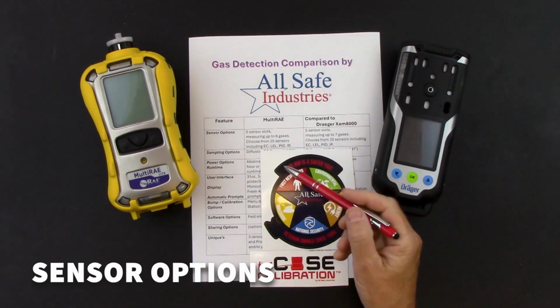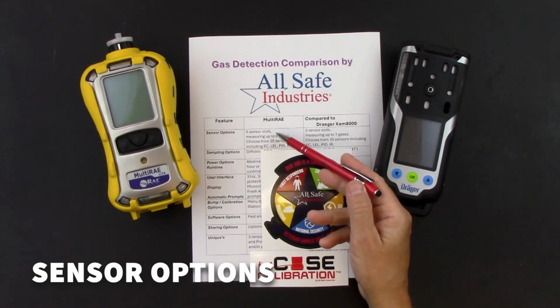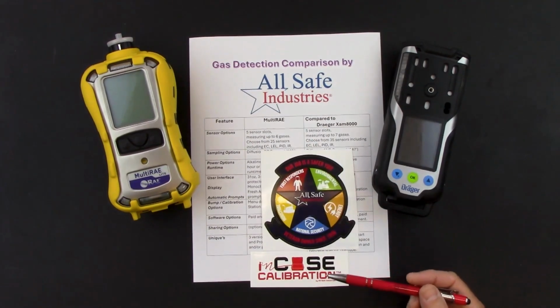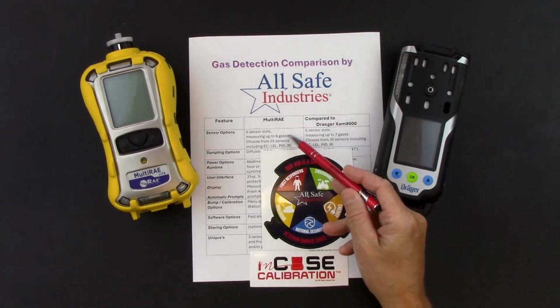So for the MultiRAE, we have 5 different sensor slots measuring up to 6 different gases. We're able to do that if CO and H2S are in your configuration. We can measure both of those gases with a combo sensor, and that's how we can get to 6 gases on a MultiRAE.